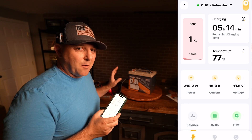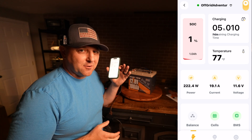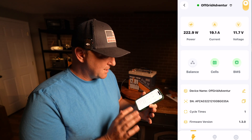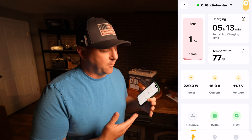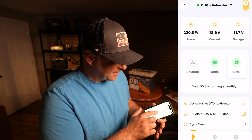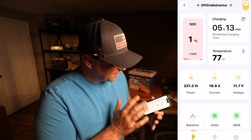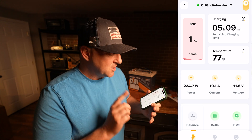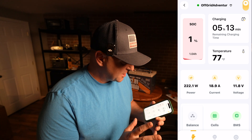To get charging started, I hooked up my 20 amp charger and connected the screen with the Bluetooth features. One thing to point out is that the Bluetooth app is great for observing what's going on inside the battery, but it doesn't allow me to do much — I can't turn on or adjust the BMS, and cell balancing doesn't appear to be an option. It shows the internal temperature at about 77 degrees Fahrenheit. I'm curious to see if it will show the temperature dropping below freezing. At about 200 watts input, it would take at least five or six hours to fully recharge.